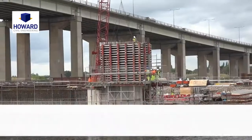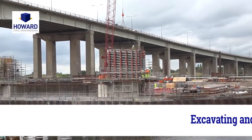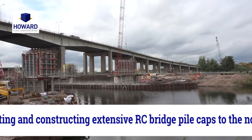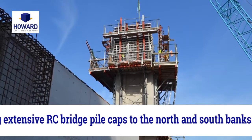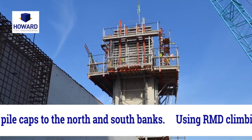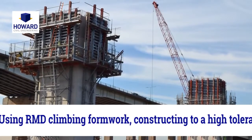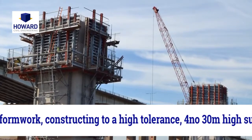Currently, as you can see, the central abutment to the south has been poured. The second pour to all the towers are progressing well, even moving to the third pour on the southwest. We'll see the ascent platforms with the external shutters all applied in one lift — external shutter, platform, and trailing platform all going up in one.